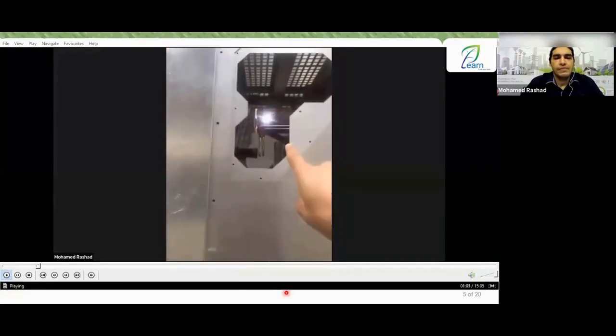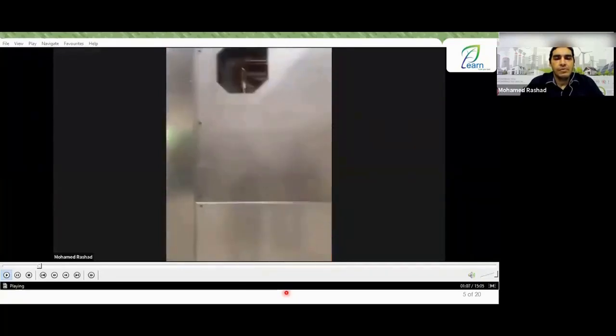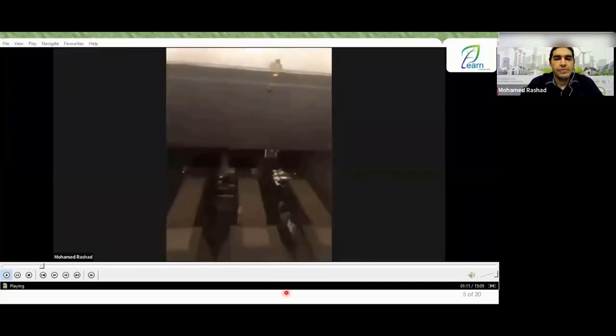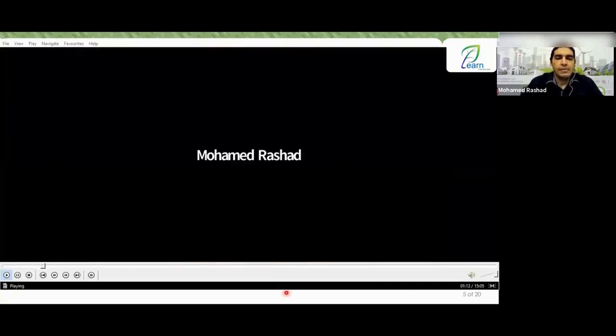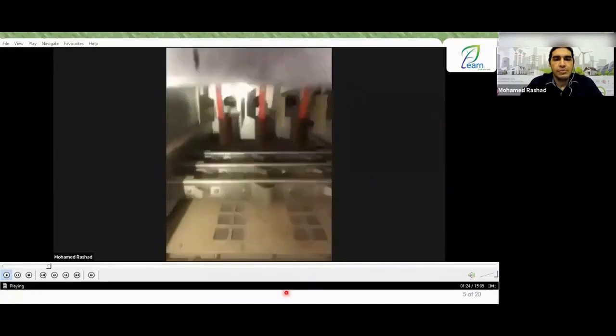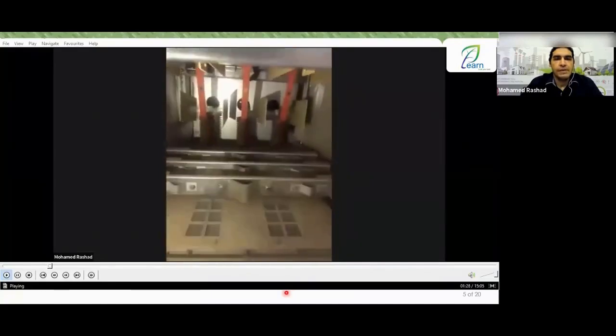From the back, you will have the upper part containing the bus bar, your three-phase bus bars, and in the middle section, exactly as you can see here, you will find the three current transformers, the three-phase current transformer, and the last part, which has the cable termination end, so that my cables will finally connect here, as you can see, the bus bar, for example, the red phase, the yellow phase, and my blue phase, very nice.